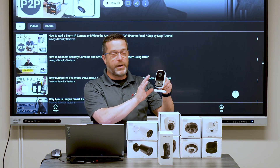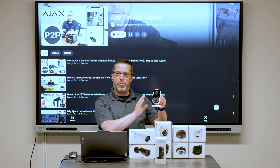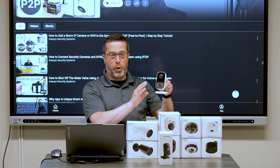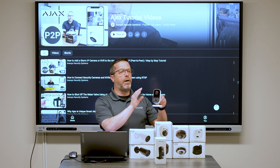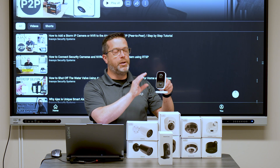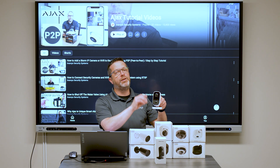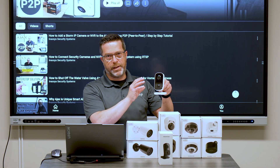This is a Wi-Fi camera, so no ethernet cable is required. If the Wi-Fi goes down — for example, if you're replacing the router or there's something wrong with the Wi-Fi — the camera will still communicate over the proprietary Wings and Jeweler channels from Ajax Systems. You can still receive snapshots and detection or PIR events in your app without Wi-Fi. When Wi-Fi comes back, you get live video and seamless recording on motion detection events.